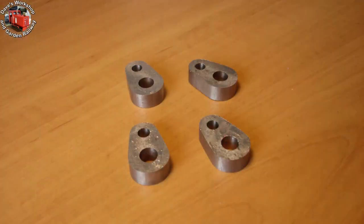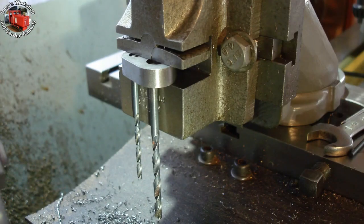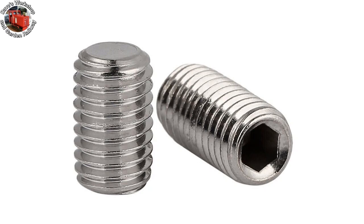The 5/16 inch hole has just been reamed. Here they are apart, ready for cleaning up with abrasive paper under a running tap. Drilling through 2.5mm for M3 grub screws on both sides — this is the same as on the quarry Hunslet. Here's the setup to get the crank in the correct orientation for drilling. This is the style of grub screw I use — flat bottoms so they don't damage the axle too much.